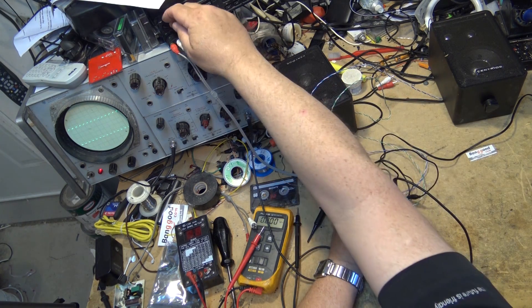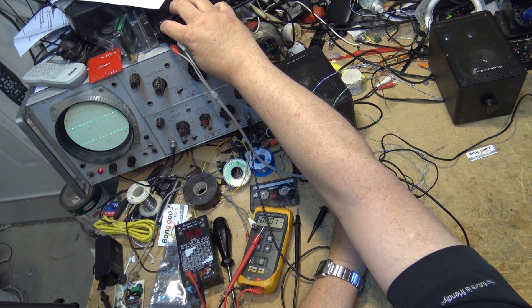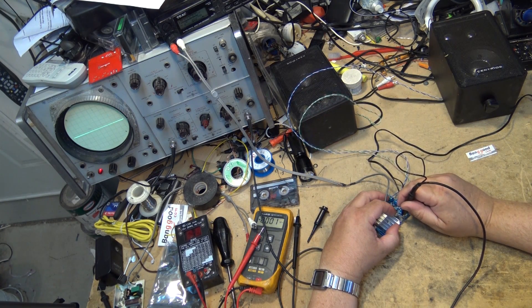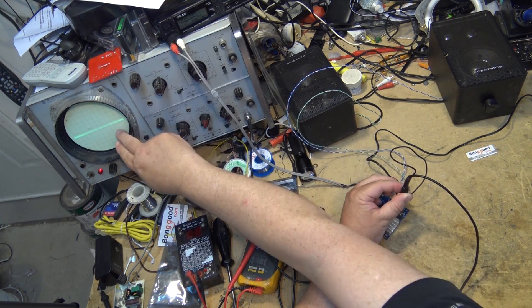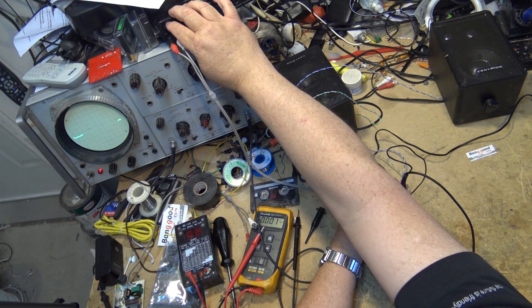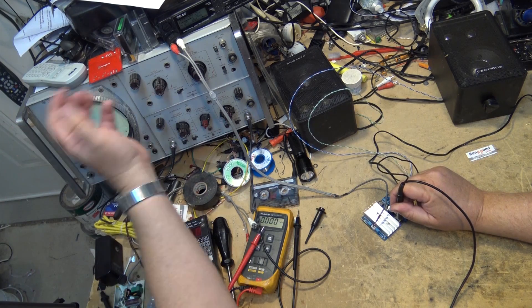When my next song starts you'll see the square wave change. We're creating deviation, and this low pass filter — if we go to the other side of the filter here, which is just the other side of this inductor — we've removed the high frequency component and we're just left with the audio component. If I drop my sweep rate back, there's our audio. The level of our audio is dependent on how much of a swing there is from the fundamental frequency. If we go back and look at the carrier at this sweep rate, the carrier just looks like a flat line.